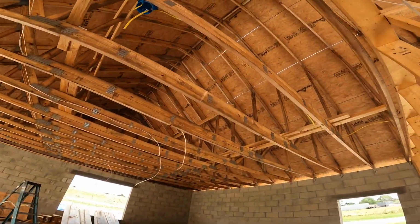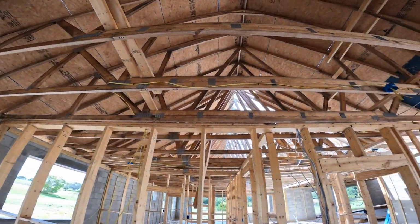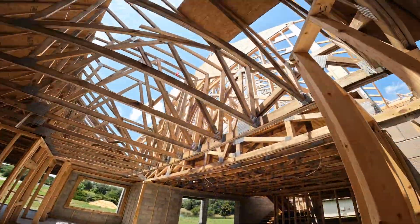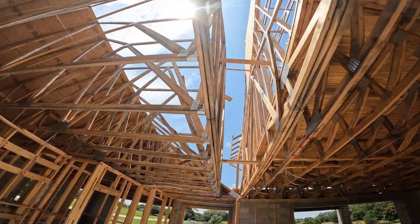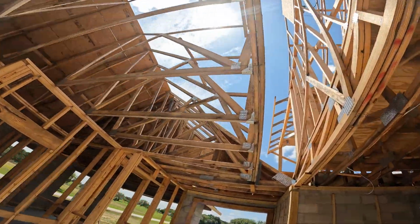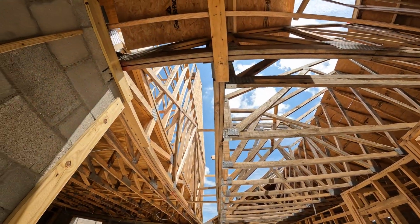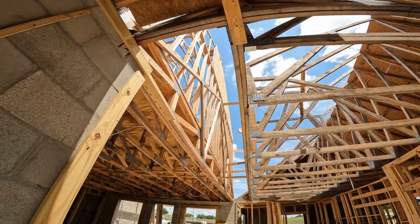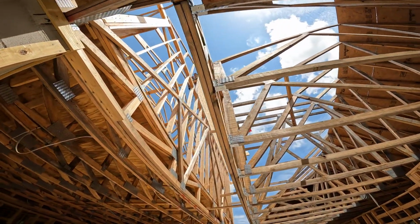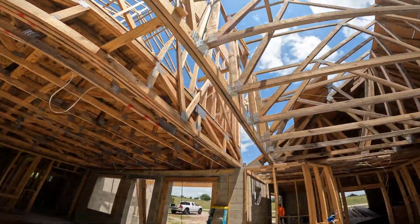So this is the reason why we have these issues of the roof waving, bumping, and not in line or in plane with one another. This is the area that should have been taken care of at first also, which was relayed to myself, which never got done. So as you can see, this is not lined up. None of this double truss here is lined.